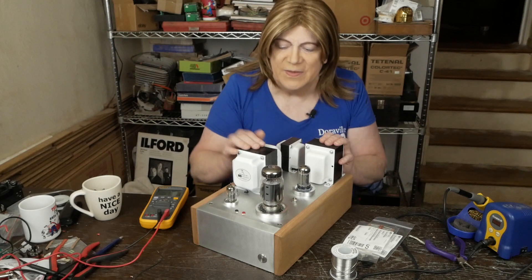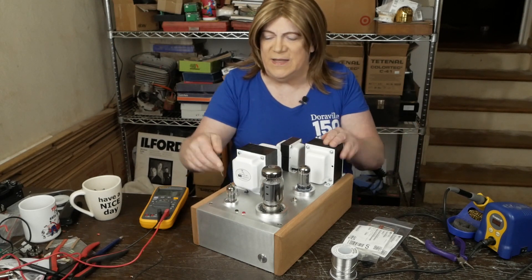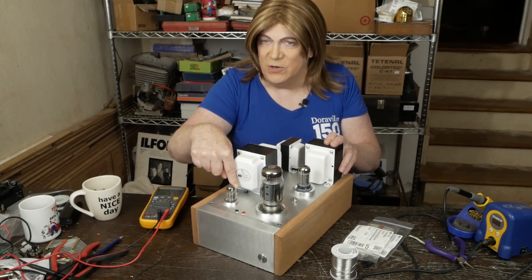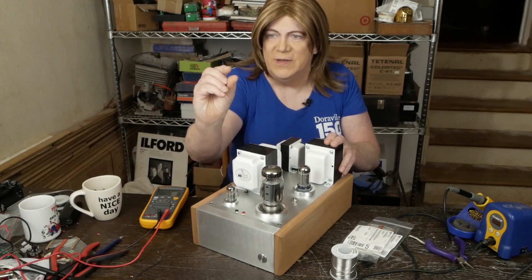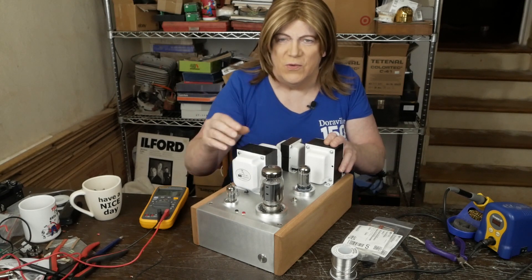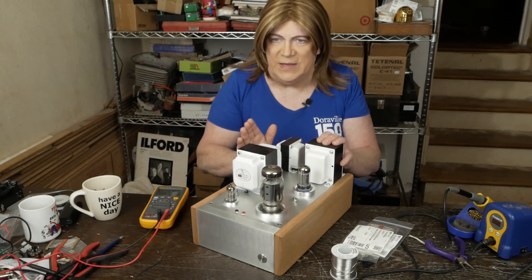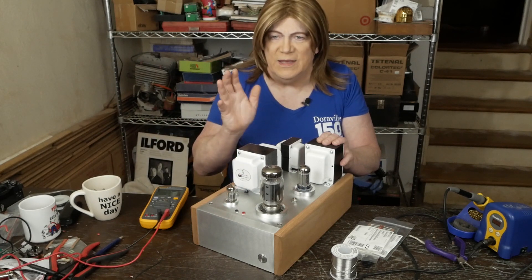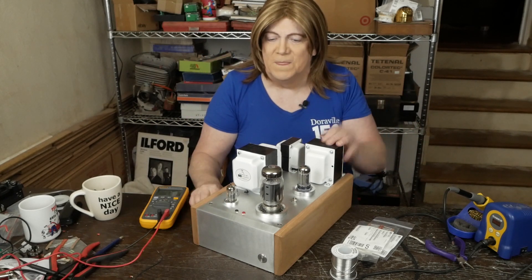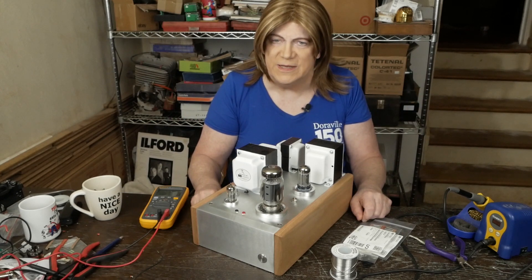Having the test points right up front puts them next to where they're measuring without wires crossing each other. The other thing I really like about this design is putting this RCA jack right here — the signal path from the RCA jack to the tag strip is about a half an inch long. So there's no need for any kind of shielded wiring inside it; you can have all the shielded wire on the external interconnects that you're going to use. I'm just really excited the way this thing's turned out.